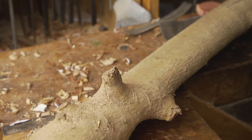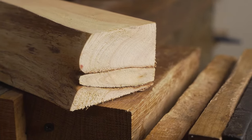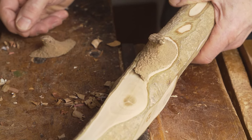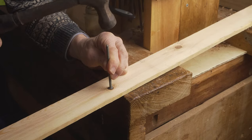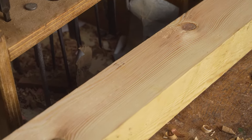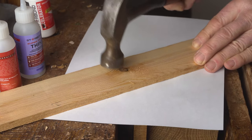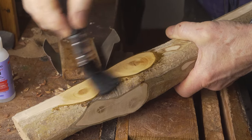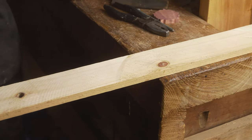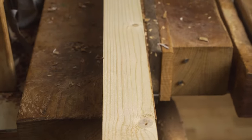In this video we focus upon knots, how we deal with them and the different types of knots that there are. You have both a dead knot, a live knot, and then ones that are kind of 50-50. A dead knot is one that in time, or immediately when you work with it, it will fall out — as the wood shrinks and dries the knot becomes smaller and drops out. A live knot will not do this in the same way; it can often split in the drying process but won't fall out as easily. Then you get knots that are in between — live on one side, dead on the other — and in time these can also fall out and cause a problem.